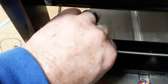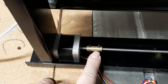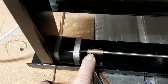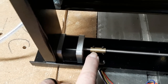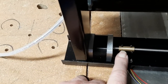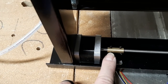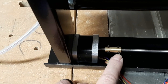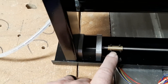One of the things you want to do is make sure that you check the tightness of the screws on this coupling. In fact, before I put this all back together I'm going to pull these out, put a dab of blue — blue, not red, but blue — thread locker in there. Red thread locker is semi-permanent; you'll destroy the grub screw before you get it out. Blue simply locks the screws in place so that they don't loosen over time.